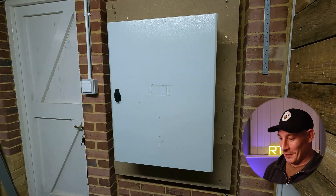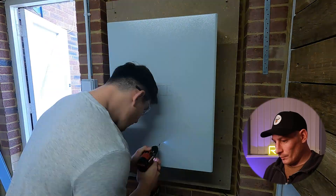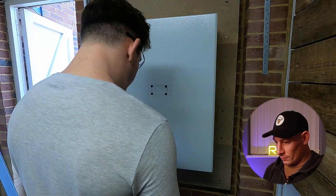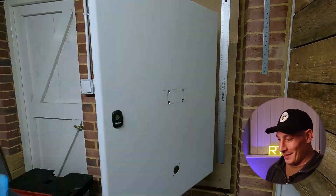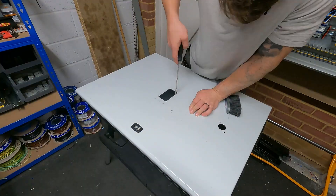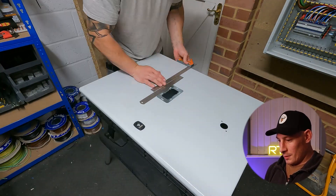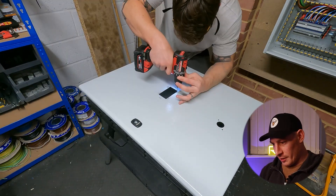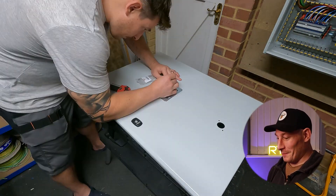You can see I'm using the laser method to mark the center of the shaft for the door isolator — always a bit of a squeaky bum moment doing that. Then giving it a deburr, and getting that mounting plate nicely square before fitting the touch screen. Those holes were properly drilled and tapped — no tech screws used there.